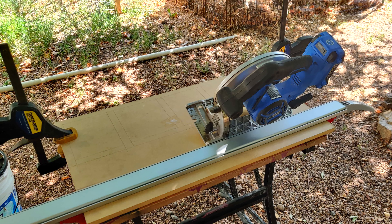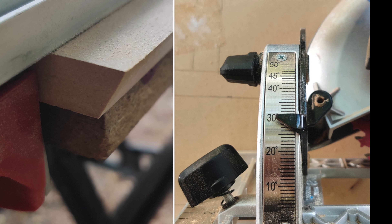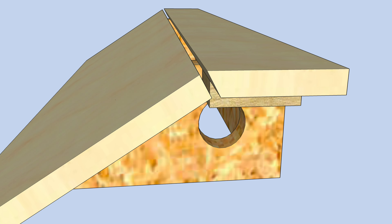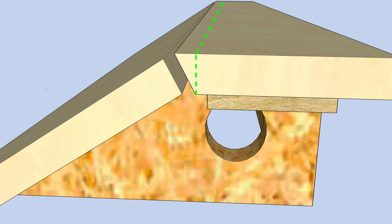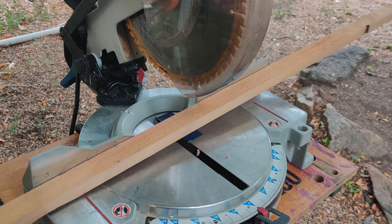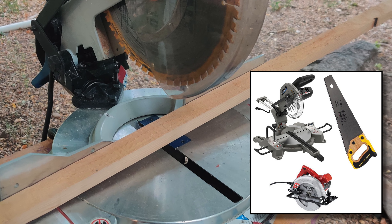You can use just about any type of wood for this project, as long as the material for the wall-mounted base is thick enough to solidly hold screws. I cut the platform and shelf from the same piece of MDF using a circular saw and a cutting guide. Though it isn't necessary, I made a 30-degree angled cut between the top of the platform and the front of the shelf. This way the cords have a channel to go through, and the angle makes the channel smaller, eliminating the large gap that would result from 90-degree edges. I used a miter saw for cutting the divider pieces, but if you don't have one, a hand saw or circular saw will get the job done.